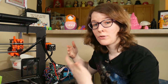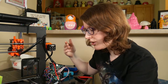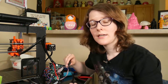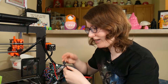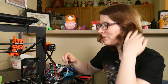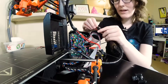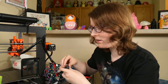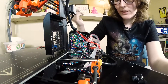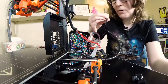As you know, I print a lot and do a lot of projects with 3D printing, so I didn't want to be down for a really long time. I started researching what could cause this. Kirby on Twitter — I did post a picture of the melted connector because I was admittedly a bit depressed after it happened — he suggested that maybe the connection was actually a little bit loose, and because of that the resistance built up and caused it to overheat and melt.